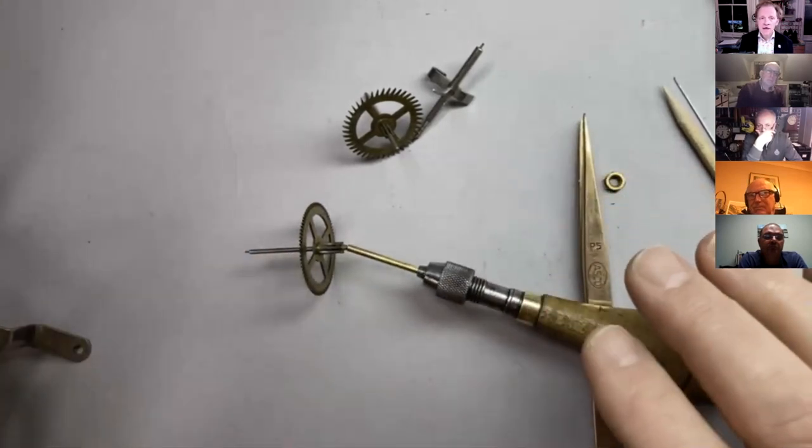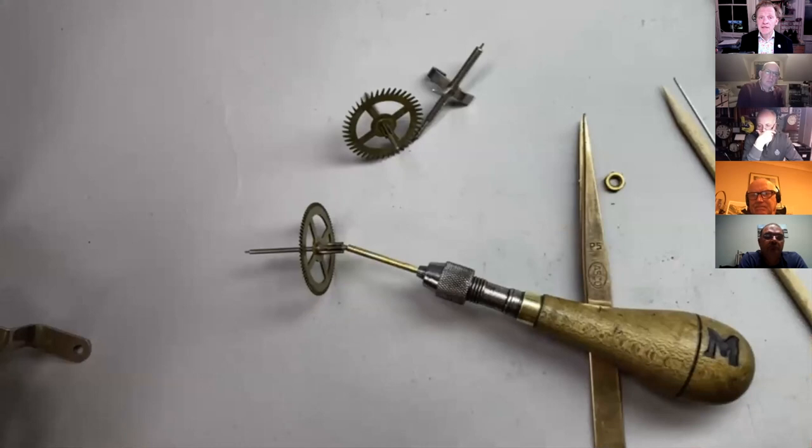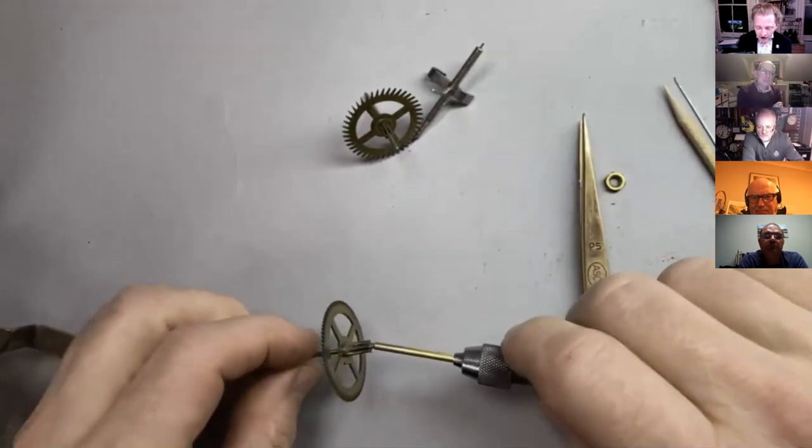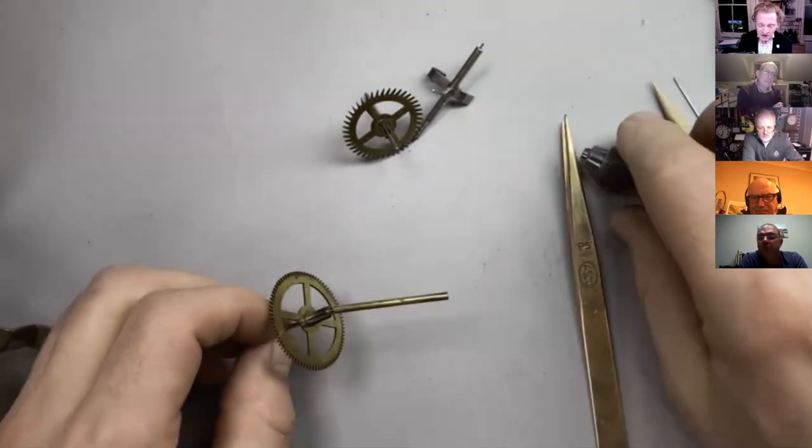So I would say check that it's already tempered to blue. By doing this, you can just clean off a bit of material with a bit of abrasive paper or something. So you've got a bit of white steel, heat it very slowly with the spirit lamp. And then when it's blue, just allow it to cool. And then you've got your best chance of being able to bend it, and it'll still be springy. You haven't taken it so far that it's not going to be springy anymore. Right, this is still quite warm, as you may imagine.